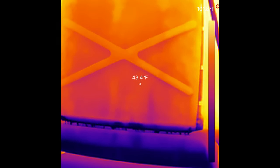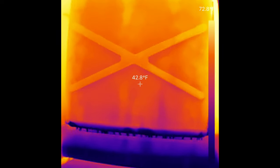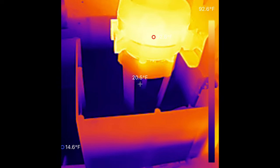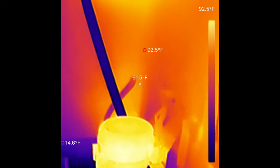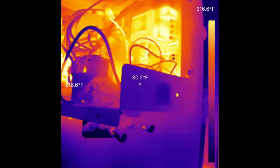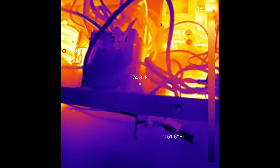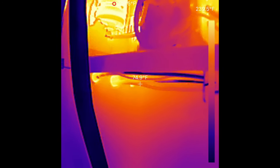I broke out the Topdon TC002 thermal imager and we're taking a look at the ice maker here. You can see the water pump. This thing has pretty good resolution. There's a video on it on my channel, check it out. You can see the relays on the circuit board, the transformer on the circuit board getting a little warm. And then check out the PTCR for the compressor. That thing's a scorcher.